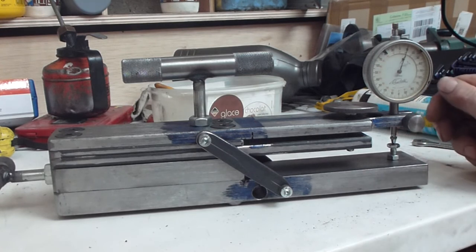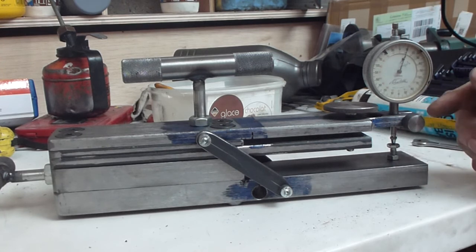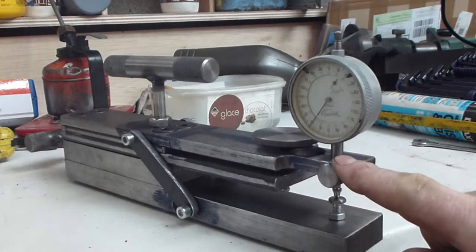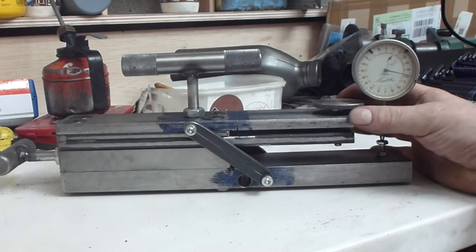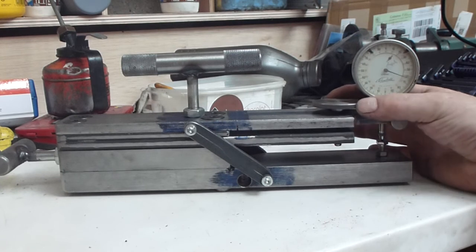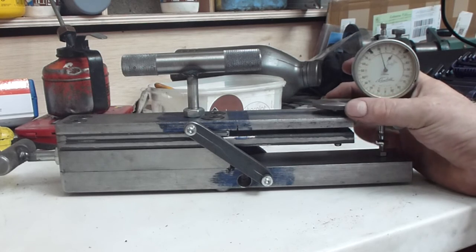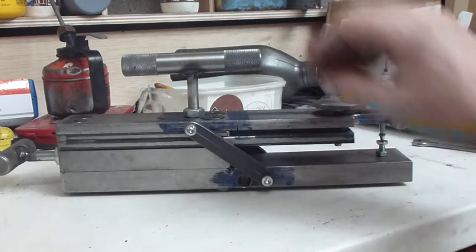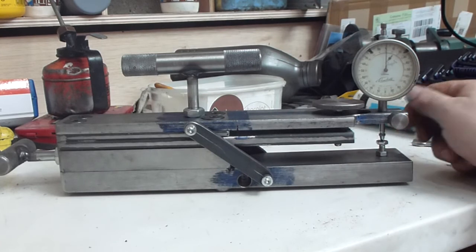Well, here is the completed rapido meter, which just needs a coat of paint. I didn't do anything about knurling the screw for here or knurling the edge of the disc. Just to point out that the adjuster has straight knurls, and everything that is gripped has diamond knurls, which is common practice.